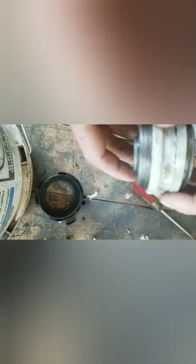I'll sit it on the bench and give this tab a shove - see how the hole doesn't line up anymore. At this point I can pry it apart; a flat blade screwdriver will help. Remember we've got this case under tension from that seal - this blue seal is a dust seal and it's gripping that hub. If you're doing this on the planter, they won't come off the hex shaft so you really can't lose parts. If you have meter-mount style clutches though, you can - we'll get to that in a bit.